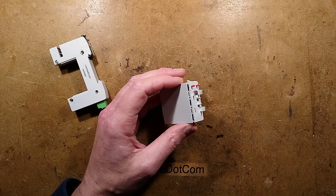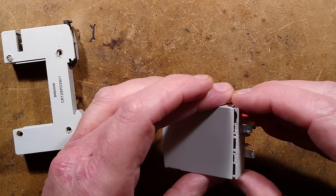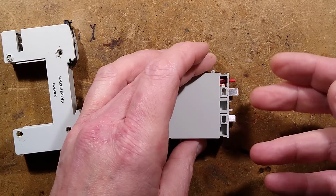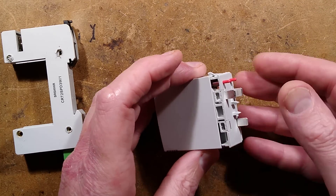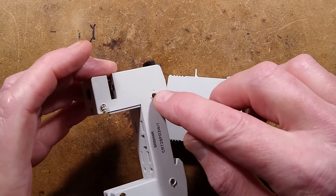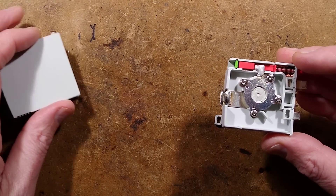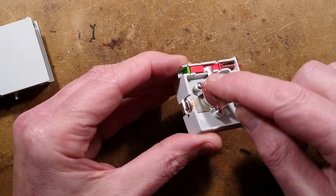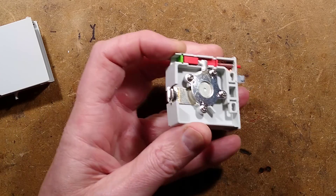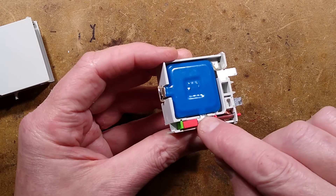That took unreasonable force, so this is not going back together soon. Taking a close look inside, I can see there are little solder bits - the release mechanisms, the over-temperature mechanisms, the safety cutouts that fire these pins up. I've got the soldering iron on and pre-drilled these so we can open that as well. Sliding this out, we have an odd arrangement - a small metal oxide varistor sandwiched on this side. Let's trigger the mechanisms first because there's a meltable link on each side.